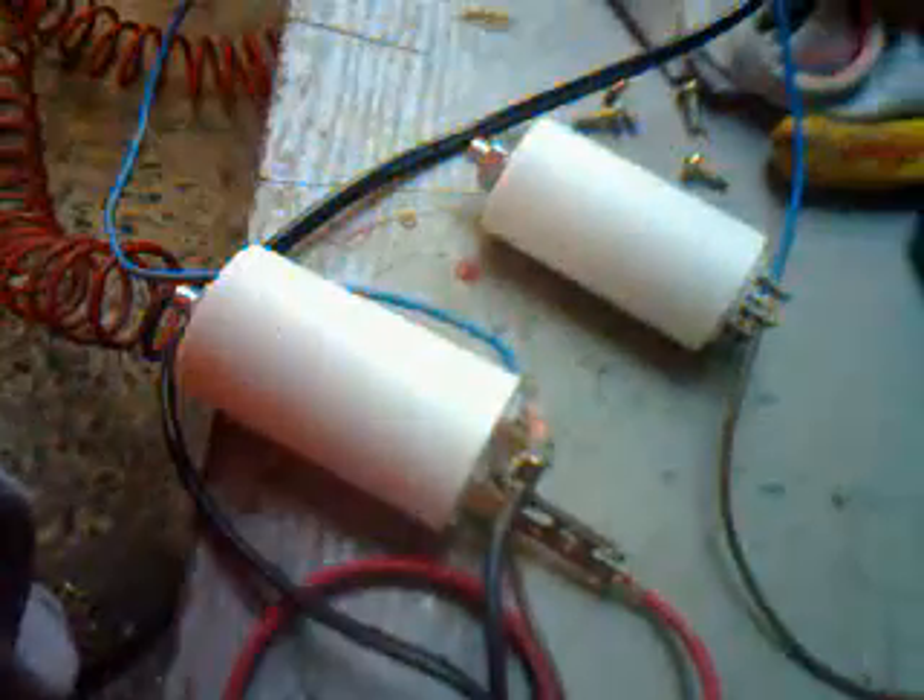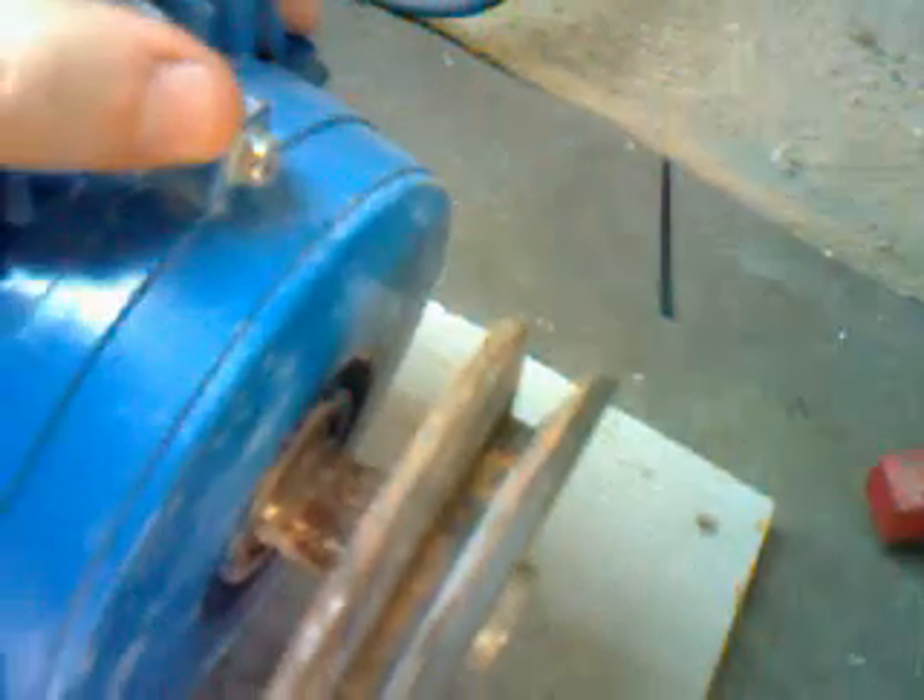Sorry, I'm rambling. So I could get some more capacitance, but if it works on 30 it won't work on 20 - it won't get up fast enough to get going. If it works on 30, I really don't want to add any more. I could get one big capacitor - like a 30 microfarad - and use the 20 that I've got there to help start it. I only need it to start to run it on load. Before it spins up I can stop it by hand on just 20, but on 30 I daren't hold it hard enough to try and stop it.